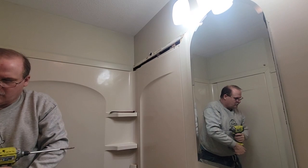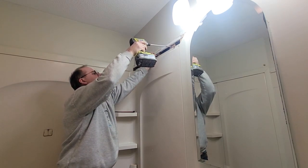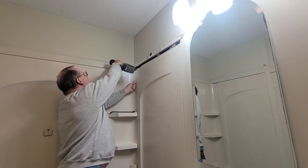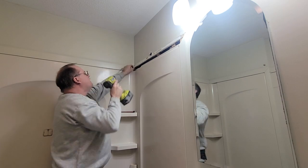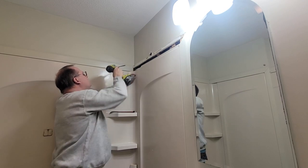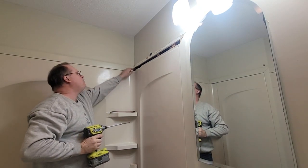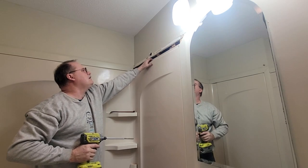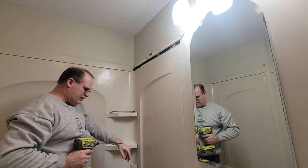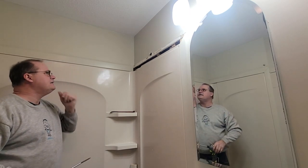So if it was about 20 years ago they say, these will just come undone. I think what we're going to do instead of a trim, we're going to run the drywall right down and mud right around it — make it look like it was always here. And then we'll be painting that yellowish color right up to it. And this is not glued to the wall, so that's good — so we can pull out this end, the back, and this end, by taking all this trim off and pulling these screws out.